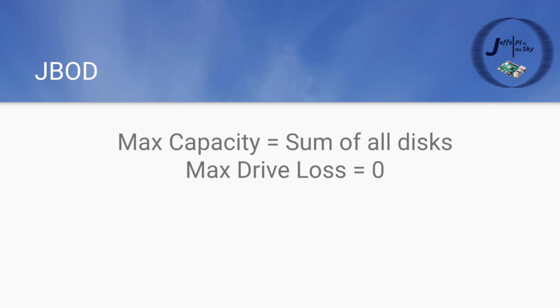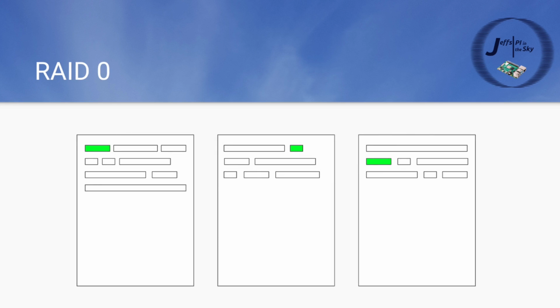So it's better if you can connect disks together in the form of an array. And a technology that allows this is called RAID. Now RAID operates at a bunch of different levels. So let's go and take a look at each of them. The first of these is RAID 0. Now this doesn't actually help a lot with resilience, but it does help with performance. In this case, if you've got a single file, then parts of it will be spread across all of your disks. So in this case, each of the 3 green blobs that you can see represent one file. Now what happens is, as you're reading the data from the first disk, it'll be in the background preparing the second disk so that all of its heads are in exactly the right place for you to then read the data for the next section of that file. So you can seamlessly just move on to it.